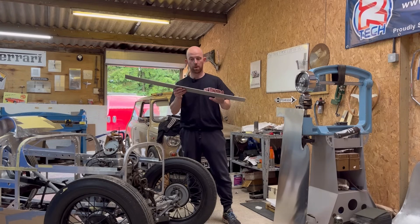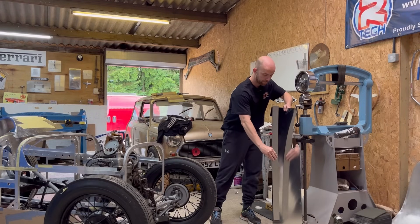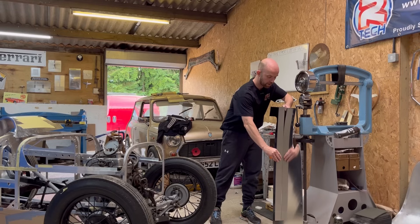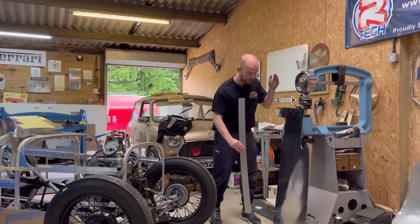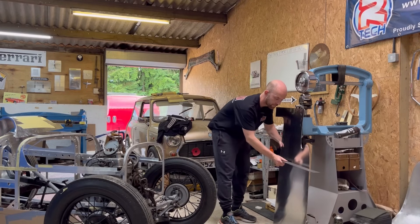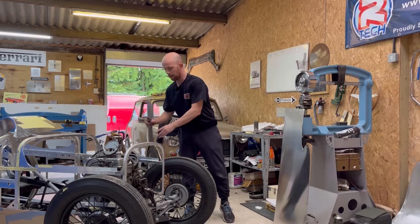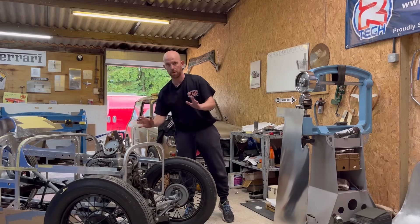This sweep is basically a guide that I'm just going to be checking with. It's easy to add a bit of pressure and create shape going one way, but what we want it to do is go in both directions — so that's why we're going to be wheeling it. And it'll make a huge difference once that panel is done.